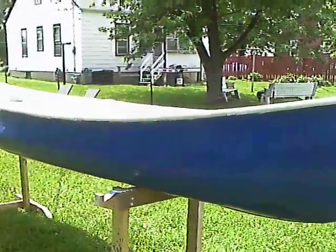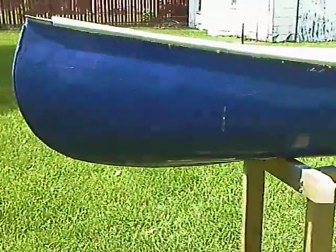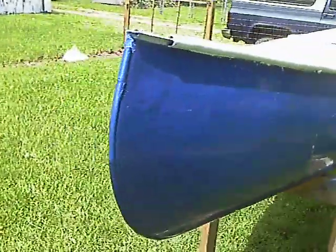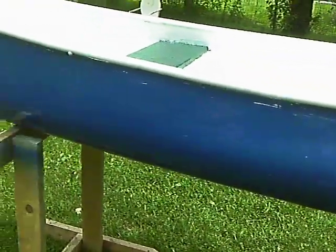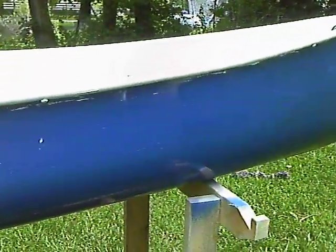As it turns out, the weather was a lot nicer than I thought it was going to be, and I did go ahead and paint the outside of it. I just bought a quart of enamel. I couldn't get my compressed air spray gun to work for some reason — it wasn't functional. So I used a Wagner airless electric sprayer. Mixed it with a little bit of acetone — about a half a cup of acetone with a quart of paint — and it finally started spraying out. I got a few heavy spots where it spit and it ran.